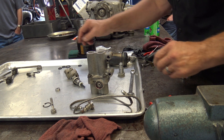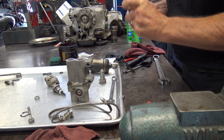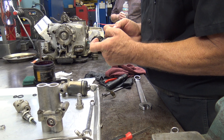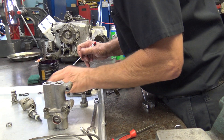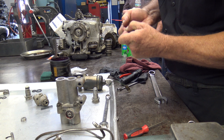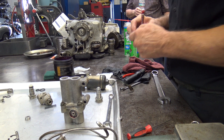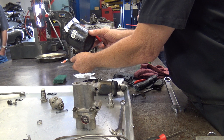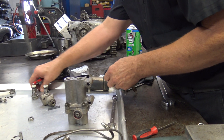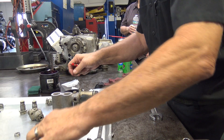Then this spring goes in, then we can put these O-rings on these things. I'll lube them when I put them in. If I lube them before, they flip out of my hands and I sit there for an hour. The lube is compatible — it doesn't affect the hydraulic fluid. This is a Girling rubber grease and it's based with castor oil. The original brake fluid for these cars had castor oil in it as a lubricant. Compatibility is very important.